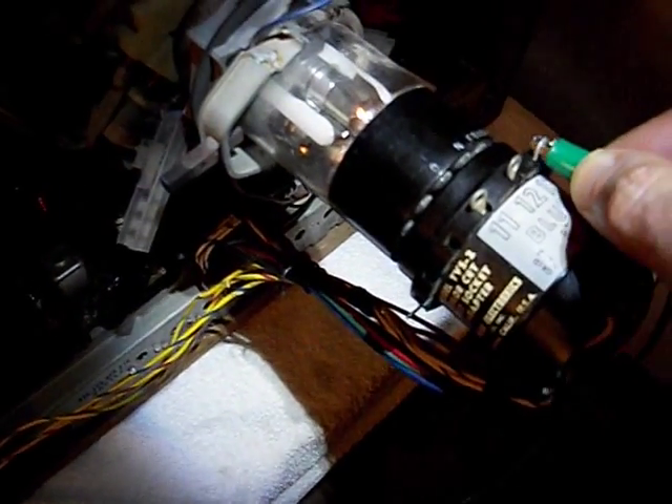And cathode is 275 volts. So another way you can look at it is the bias — it should be about 100 volts. Going between grid 1 and the cathode, I'm at 88 volts of cutoff.